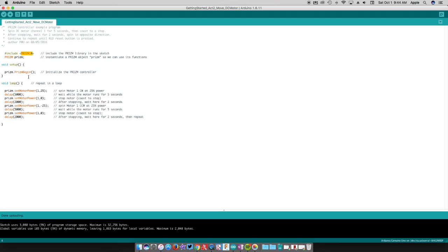The next part we have is what are called functions. The first one is 'setup.' A function is a set of lines of code that has a name — setup runs one time when the Arduino is first turned on. It does all the tasks that need to happen at startup. In our case, it activates the Prism controller, allows us to use the start button — specifically the red and green button on the Prism controller — and then terminates when done.